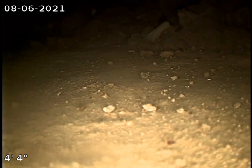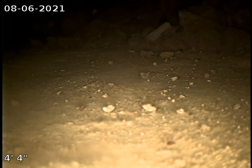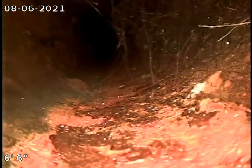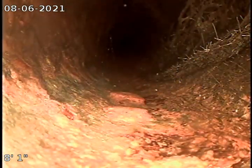All right, we're at 1209 Wilson Road in Havertown. We're at the base of the sewer line. We pulled the clean out in the basement right by the oil tank, and we're gonna run out towards the street. All right, you can see some roots on the right side of the pipe just as we go through the foundation wall.